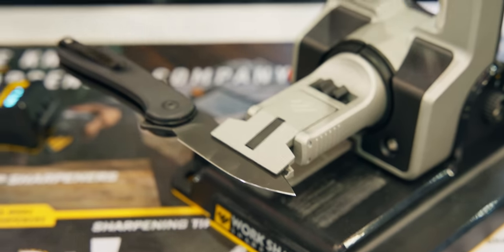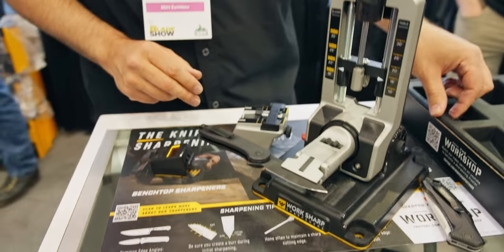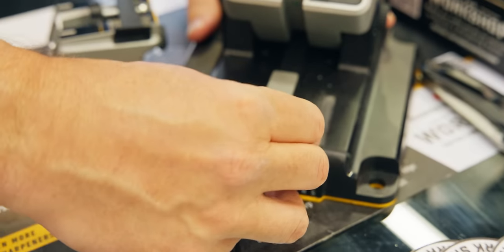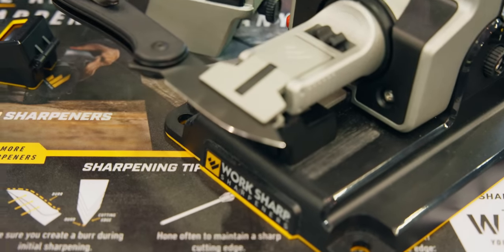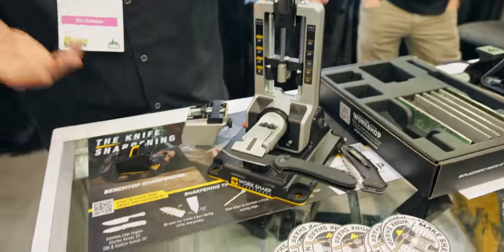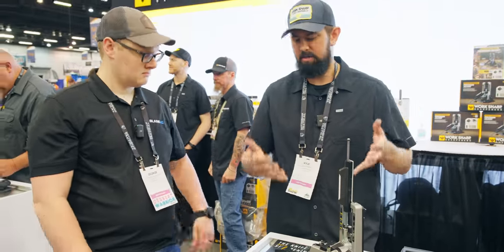We've also got accessories for doing small knives with our small knife table. And we've also got a large blade support to support the clamp that goes in underneath here for doing larger blades like kitchen knives. What's nice about that is you can still sharpen, but when you go to rotate the knife, you saw that just tilts back, hit this, rotates back over for longer knives to give you the room you need, and you're good to go. So you can sharpen all the way down from small pen knives all the way up to your big kitchen knives all in one package.